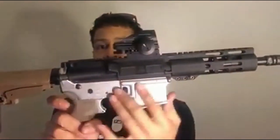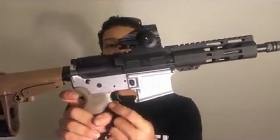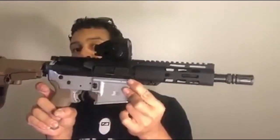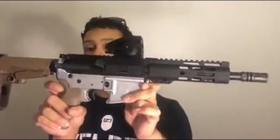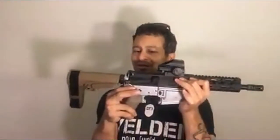The lower that I completed — I had no problems with it, everything came in nicely, except the holes on the bottom for the trigger guard have to be drilled out a little bit, and the hole for the detent spring to keep the pin locked in also didn't go in, so I'll have to drill that out as well. The kit I added to this lower was from Palmetto State Armory — really good deals, delivered right to my front door. The only complaint is their shipping time takes a few weeks.